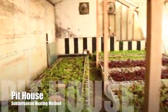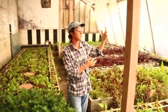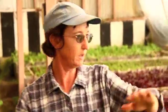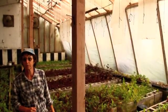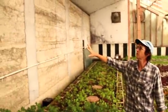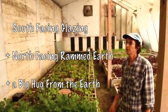The reason we can grow food in here year-round without a heater is that we're sunk four feet into the ground, so we have the warmth of the earth warming the air for us. We also have glazing on the south which brings in the heat, and we're solid on the north which keeps out the cold. The glazing is just patio replacement windows with a layer of old greenhouse film on the front for insulation. This wall here is rammed earth — 16 inches thick — just dirt from the farm. This building has been in operation since 1987.